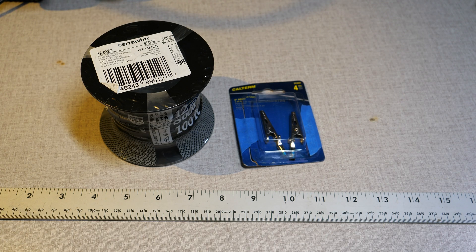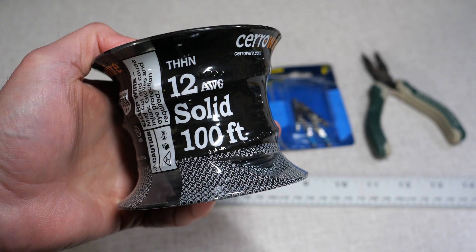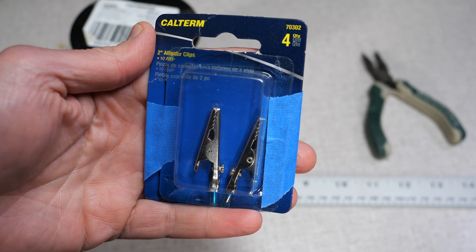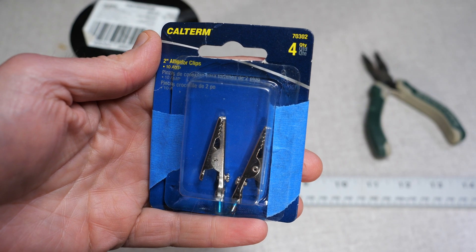It's simple enough. So with a bit of trial and error, he came up with the lengths necessary to turn the 10-meter Shark stick into a 12-meter antenna, and the 15-meter Shark stick into a 17-meter antenna. To do this, all you need is a stiff piece of wire and an alligator clip. Dave uses 14-gauge solid wire and I prefer 12-gauge solid. Both the clips and the wire are available at your local home improvement store.